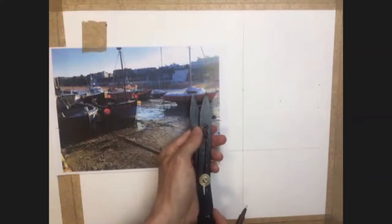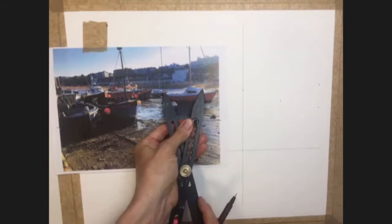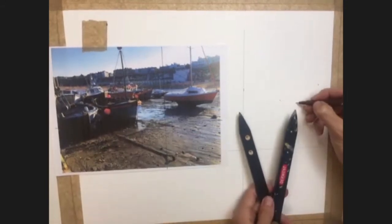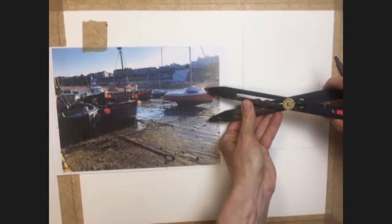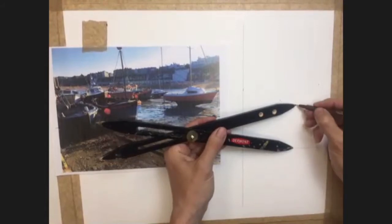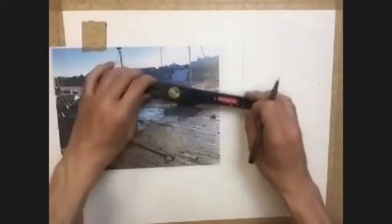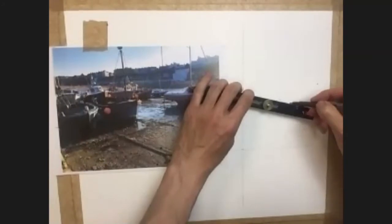Let's now figure out where the front edge of this cabin area is - again, measuring across. So I measure across like so, put a little dot, measure up. It's a bit like if you had a map and you had a grid reference like A2 or B2 - similar idea really. So there's that. The reason I measured to that point is now we can figure out where this line is - we can figure out the angle of that edge. So I can put the thing on there, come across, and that's going to give me roughly the angle of that part of the boat. So I draw that in.